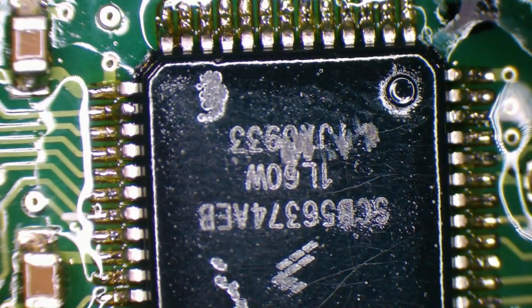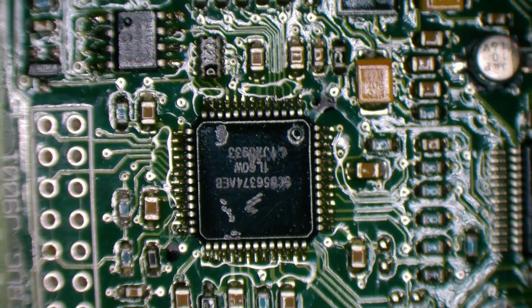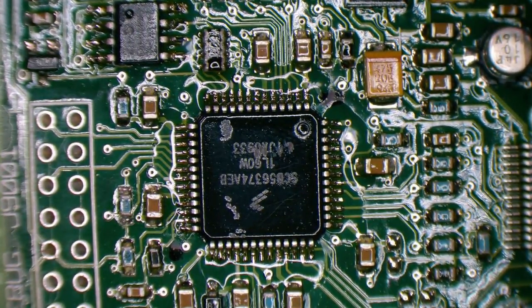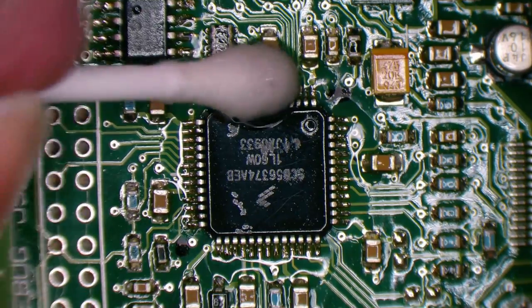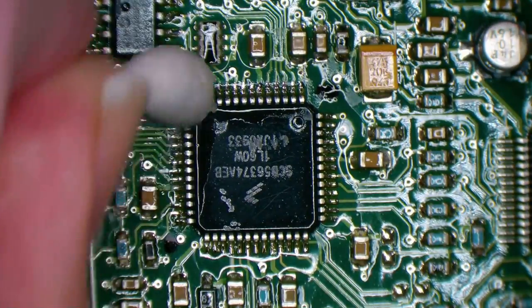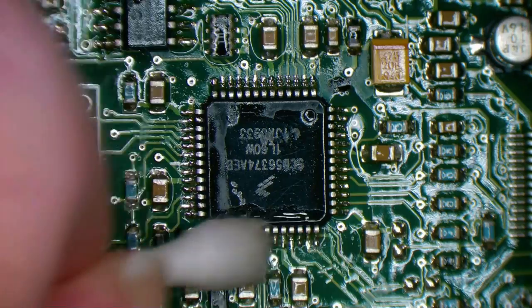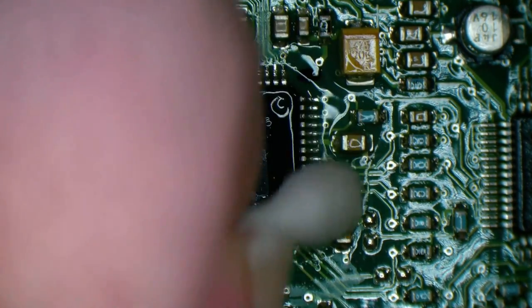Just reading through the data sheet, there's actually a whole 500 page manual on this IC, and how to program it and interface with it and so on, and trying to find anything about the boot process, but all I could see is that there is a boot ROM within it that must do a basic command to get the thing in a fetch, decode, execute cycle. It can have program memory on it as well. So what I really don't know is, does it read its instruction set from the EEPROM, or is that just for storing some sort of settings?